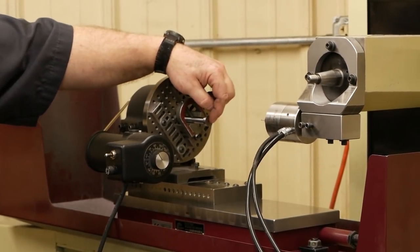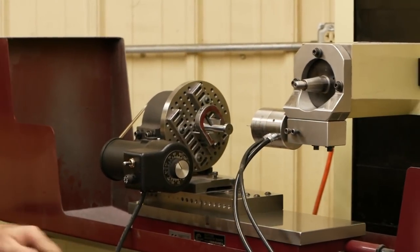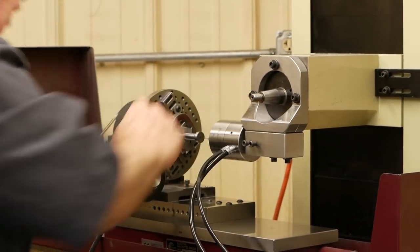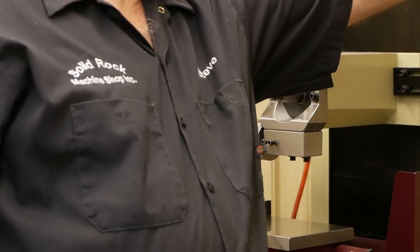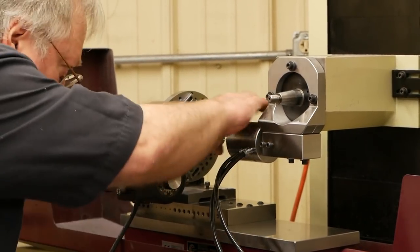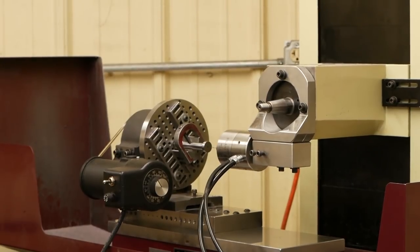So at this stage we're going to try to get that lined up without the spindle on. We're going to line that up and get real close on the center line of that hole. I won't need to indicate it because I'll be plenty close enough. Like I said, there's only 10 thousandths difference between the two here. I can go in right now and spin this spindle with my finger and I don't feel any drag. So we'll take a cleanup cut, see where we're at.